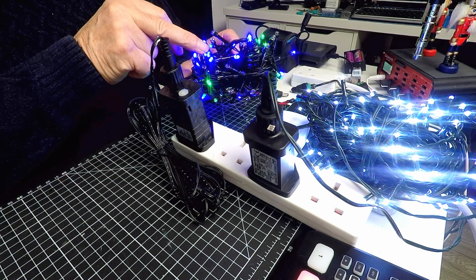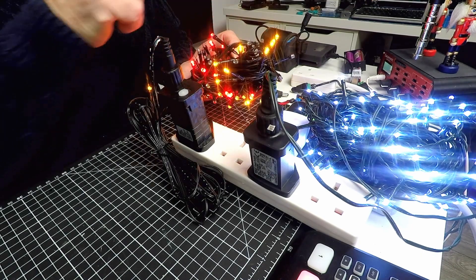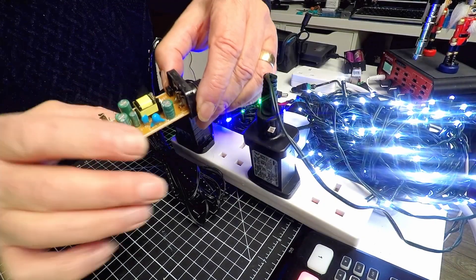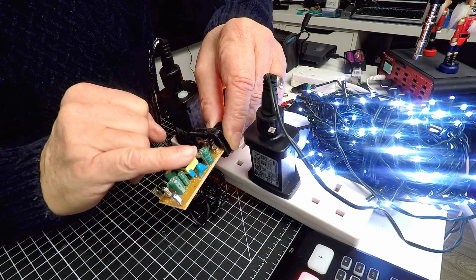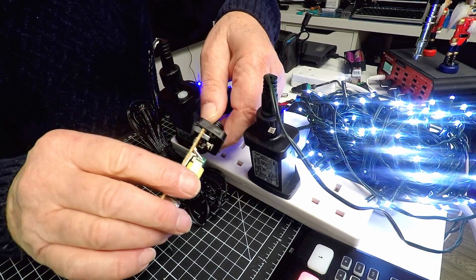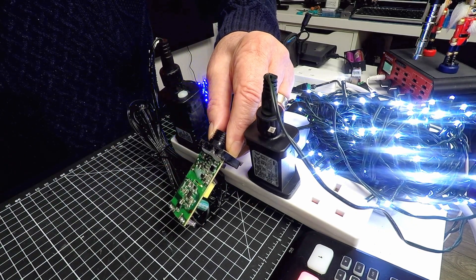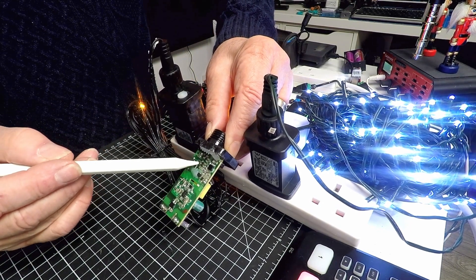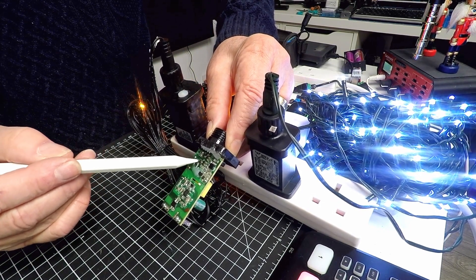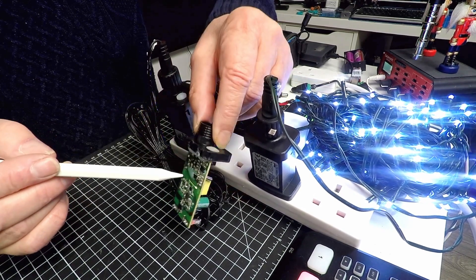These multiplexed ones can be 32 volts, or they change polarity on the phases — you can see that as the polarity changes. The actual module inside these units has the mains coming in, a switch-mode power supply, and on the underside you can see the output stages where there's a little microprocessor to do the switching, two p-channel MOSFETs, and two n-channel MOSFETs, so it can switch over the polarity of the output terminals.